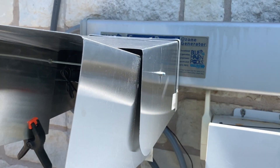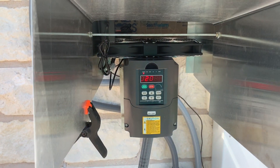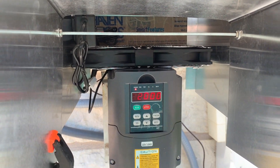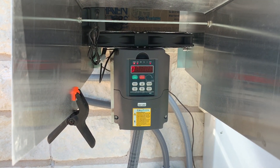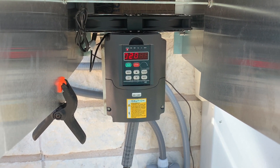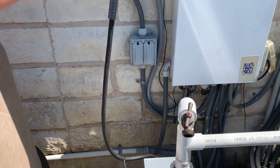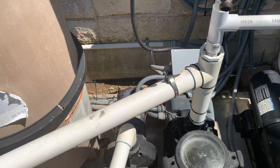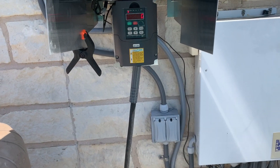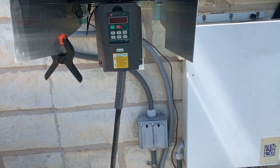Each 18-by-24-inch sheet from Home Depot is about $10, the stock costs about $1.50, and you need a couple of dollars for screws. I'm in Austin, Texas, and this is sitting on the west side getting really hot, so the fans are important. It's been running for about two weeks with no problem. It runs from 8 in the morning till 5 in the afternoon — ramping up to maximum speed for about five minutes, then mostly at 2000 RPM, going up to 2200 RPM for one hour when the booster pump comes on, then 2100, then back to 2000 and cycling continuously.